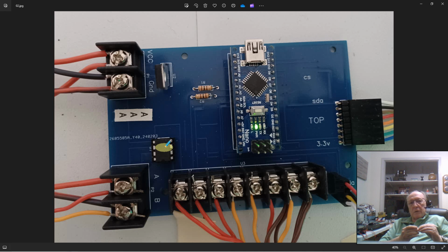All of them are listening, but only one is allowed to talk. And in serial communications, this is often referred to as polling, and polling uses what they call the token. The server will send out a packet of information that's addressed. Everybody listens, but everybody says, is this my address? So they compare it to their address, and if it is, they obey that command and reply back. If it's not addressed to them, they simply toss that message in the trash can. So this chip here says, I need to talk, and it pulls it out of the listening mode and puts it into the transmit mode so that the Nano can push its information out onto the network and send it up to the server. Everybody else stays in the listen mode and doesn't interfere. So probably more than you wanted to know, but I felt I needed to tell you about it.